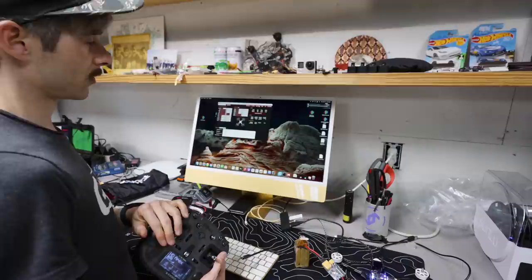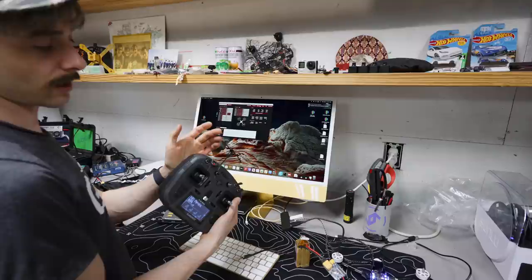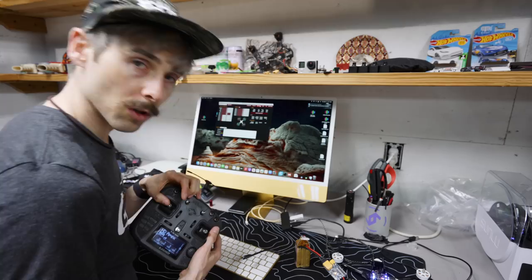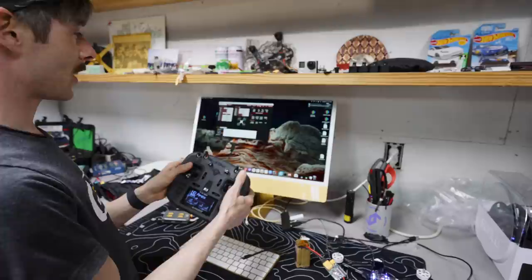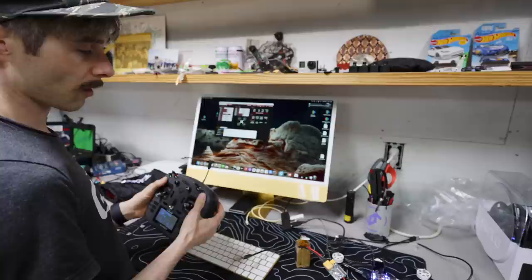It is kind of sketchy because if I have my throttle at middle position and I go here, the motors will spin at idle, and then as soon as I go there, they're immediately at 550 or whatever. So you could do a full launch mode if you wanted to. I don't recommend it. And then we have aux 3 over here, which is what I use turtle mode for. And then I've got aux 4 here set up for level mode in case for some reason you lose video signal and you're a million miles away and you just want to pop into level mode and throttle up, see if you can get video back as a possible failsafe.